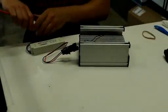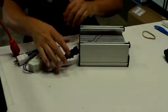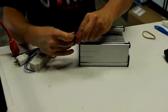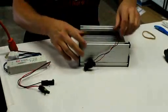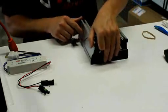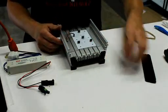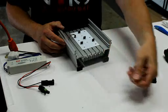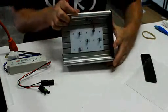So I'm going to unplug this. The reds have a lot of intensity as far as the algae is concerned, and they're very focused on the wavelength that the algae needs, which is why I use them. Now, like I said before, I've taken the end cap off. There's a splash shield in here, so you can take that off. And I'm going to show you a little closer.